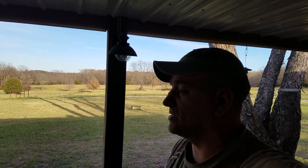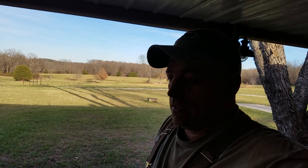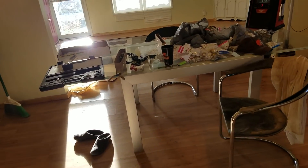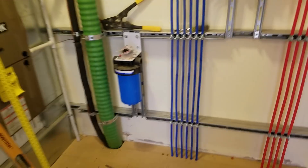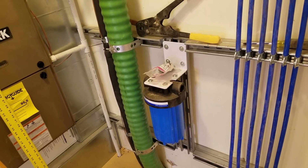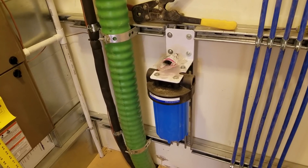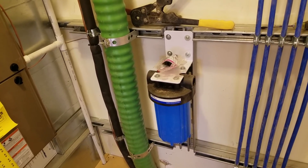It's about 70 degrees today, the day after Thanksgiving — really nice, but I'm stuck under the house all day. Getting into the afternoon now, I need to start cleaning up and getting organized. I need a couple parts — I think I can just run into the closer town rather than going all the way up to Rurala. I need a one-inch to three-quarter reducer. My main is three-quarter but I wanted the bigger whole-house filter, which only came in one inch, so I'll just reduce into it.